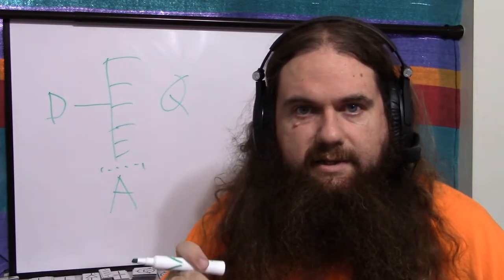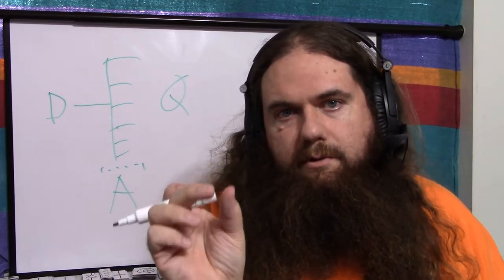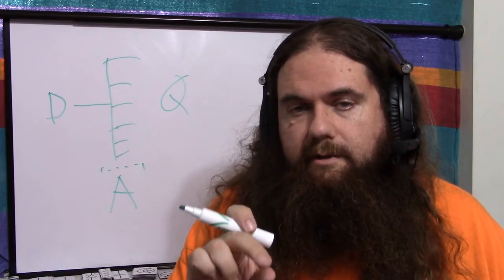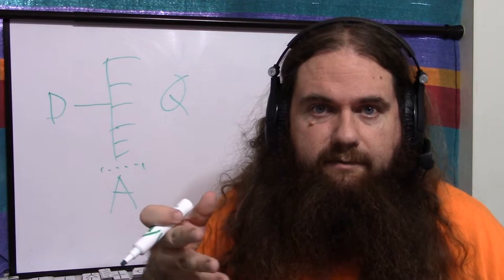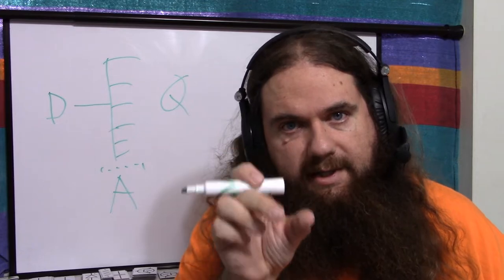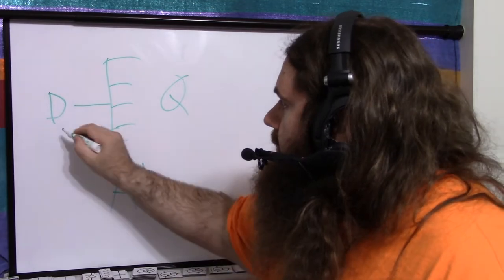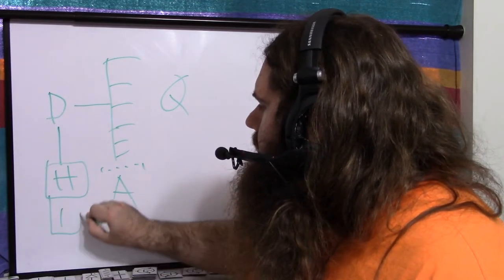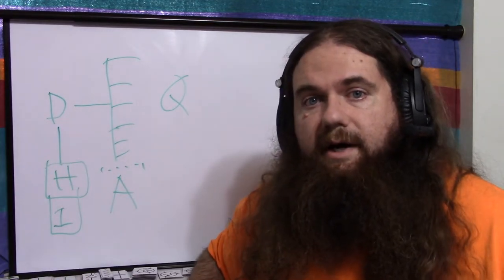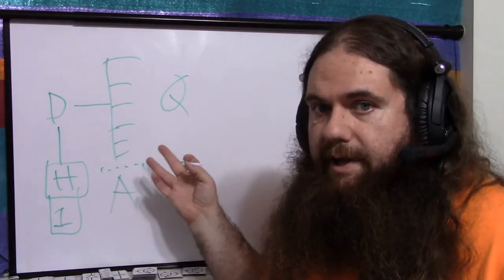Let's say you have 6 devices on a bus, and you want to turn on one of those devices at a time. So you use fewer pins from your microcontroller to send a binary number to the decoder. The decoder has a whole bunch of pins because it's cheap to have a decoder with pins, and that is going to send an enable signal to one of these devices, whichever one is the index. So it's actually exactly the same as the demux, except data is high, always, or a 1 if you prefer. Instead of having data be an actual signal that can be high or low, data is just tied to high, so that when you demux, you're always demuxing a 1, and it behaves as a decoder.